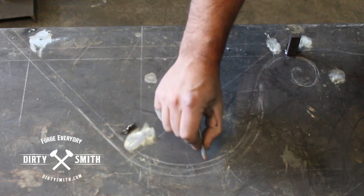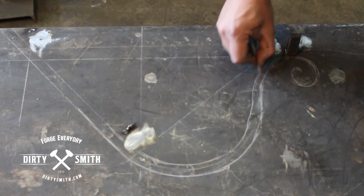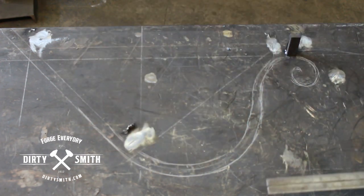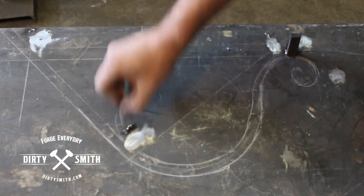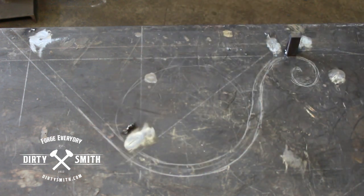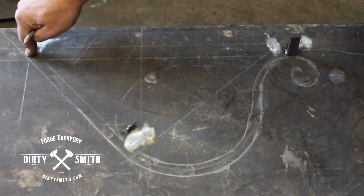Based on budget and what they're willing to give you, I went and got different jigs we have and found a radius I thought was nice and found a smaller one. I literally drew out a circle right here and drew out a circle right here and then just free-handed it in. I had a 90-degree bend and my 10 inches I needed to clear, and based off my notes I knew where the next tread was going to be and how high to set it.